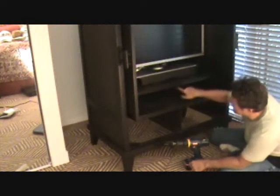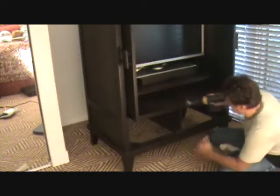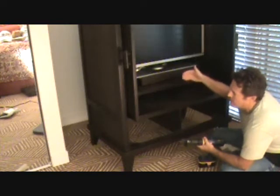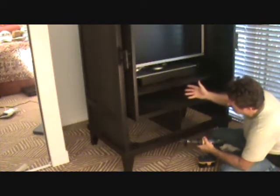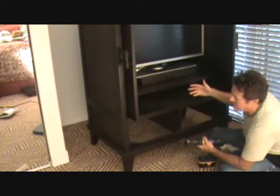And we're going to reach back in here, and we're going to drill a hole way back in there. So you've got to put this way back in there, and I've made a determination. We're just going to take it into the middle. But before I start drilling back here, I'm going to look on the back side. I want to make sure we don't have any other cords in our way. Last thing I want to do is drill through something or nick something that's been taped on the back side of your cabinet. So check things out before you start drilling.